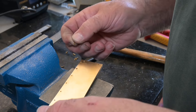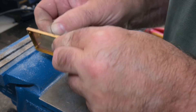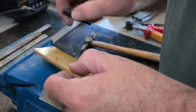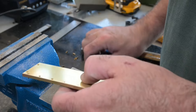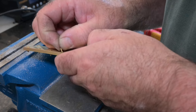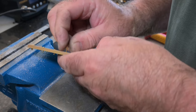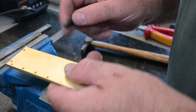For riveting, I'm using 3/64th inch rivets. You could probably use 1/32nd, but they'll be very fine. The 1.2mm hole is a nice push fit — they push fit securely into it.